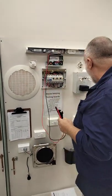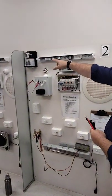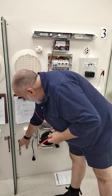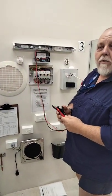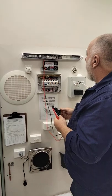This one is running an underground pit. Some of them run overhead — for example, over here we've got an overhead aerial. So it'll either be one or the other, but it doesn't really matter, it's still the same thing. We have our main earthing conductor down here on the earth electrode. We must test the earth electrode, not to the earth clip, because that could have a high resistance. So the first thing I'm going to do is check my meter and do a battery check.